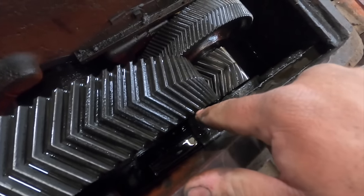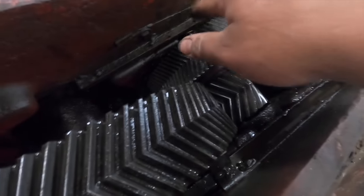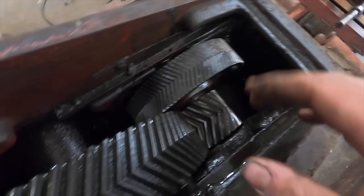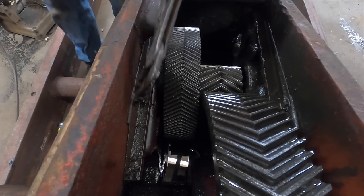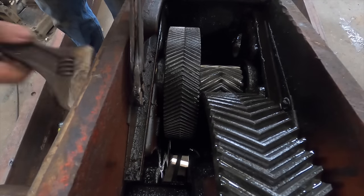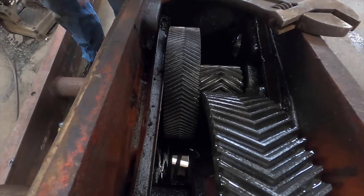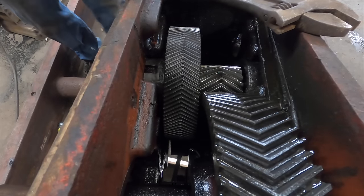It's supposed to have an oil scraper like this one over here that scrapes oil off the bull gear — that's what oils these two bearings. These two bearings are not getting oiled. It's probably in the bottom down there; if not, we can make one. I'm going to pull both these oiling trays out to clean them. There is just a single bolt in these. This is part of the oil scraper — we'll probably have to make one.